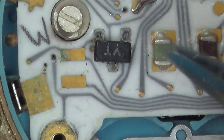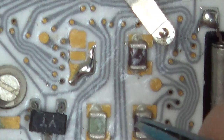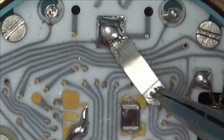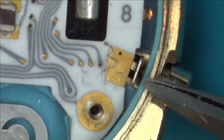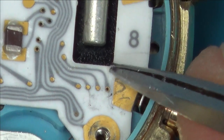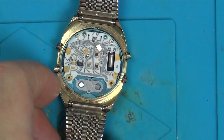We've got a transistor which is on a bit crooked, but it does look to be okay. There are resistors or maybe capacitors. This is going to be for the buzzer at the back. Here we have the crystal — there's a chance the crystal's not working if it's been dropped, that would stop the watch from working. Let's take it apart further and see the other side.